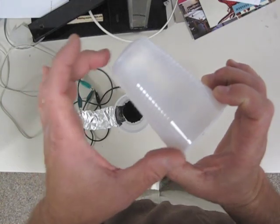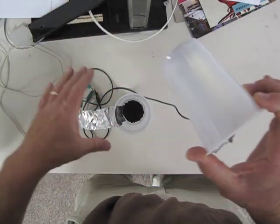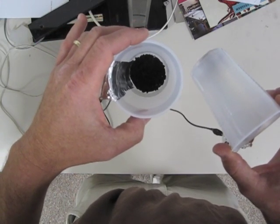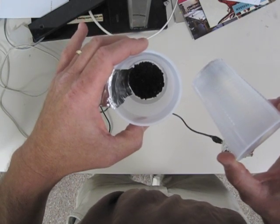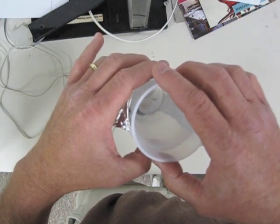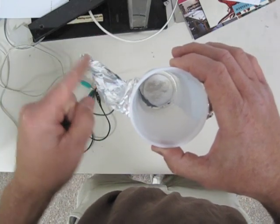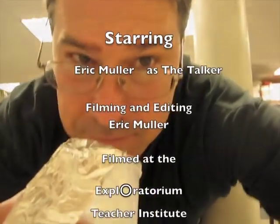When you speak into the upper cup, the bottom vibrates, and those vibrations cause the carbon inside the lower cup to be smashed together and loosened up, and smashed together and loosened up, based on the sound waves that go through it. Depending on how that carbon is held together, whether tightly or loosely, causes a change in resistance, and that resistance is what is interpreted as a sound wave through the speakers. Carbon charcoal microphone.